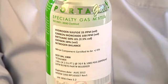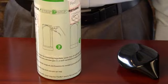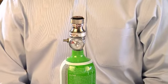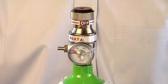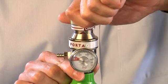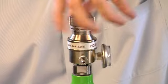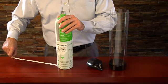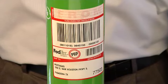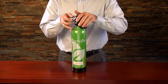Specific gas contents are printed as well. Directions for strip and ship returns are provided in both visual and written instructions. After use, ensure the cylinder is empty by checking the regulator to make sure the gauge reads zero. If the gauge does not read zero, release gas in a well-ventilated area until the gauge reads zero. Remove regulator. Strip the outer layer of shrink wrap at the perforation to reveal the prepaid return label. Place the cylinder back into the shipping tube and secure end caps to the top and bottom of the tube.